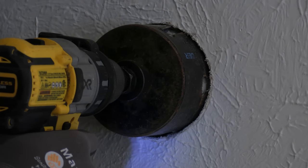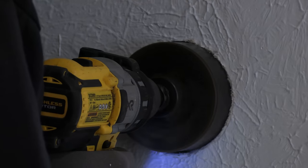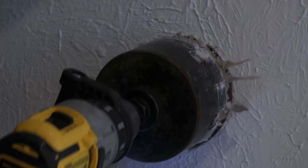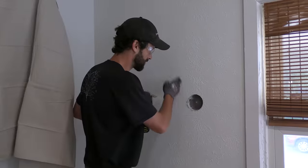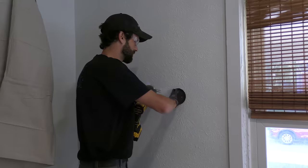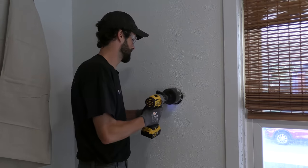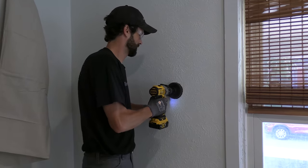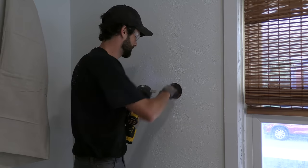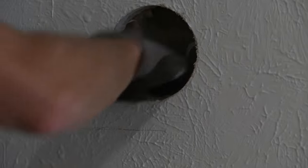Low speed, less dust as far as throwing about. Then nice and easy, because you know what you're going to find in the wall — those wires might be coming right up here. In this case I think they go down, but it might be going straight up. You've got to make sure you don't just slice into them. There it is — there's the fire block, right at the top.